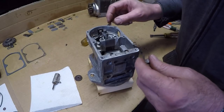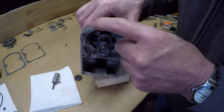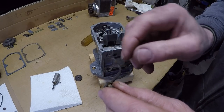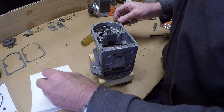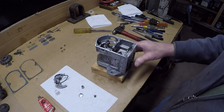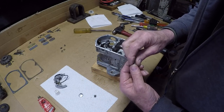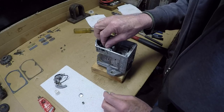Next up we'll be putting the condenser in. I did scavenge better wire for the grounding switch — that's the grounding terminal up here. You can see how it's insulated from the housing. That's what hooks to your switch to kill the mag when you want to shut your pony off. The wire has got a bare spot with real hard brittle insulation, so I had a better wire to put in there. There are two nuts on this condenser stem. The first one goes on and holds the grounding wire down. After you get the point wire and the coil wire on, the second nut goes on top of that.